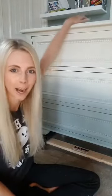In fact, up top, when I placed the drop cloth on and I let it sit, I think I see a little bit of bleed through where I sanded back a little far because I had to because of damage to it. And when I put the drop cloth on, it looks a little pink up there. So that's how you're gonna know if you're getting bleed through. So I'm gonna go ahead and just throw a little bit more primer over that pink area before I get another coat of the drop cloth. So that's what's on here right now is drop cloth.